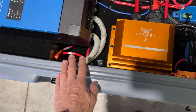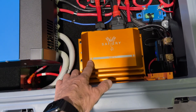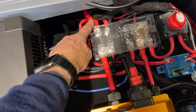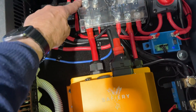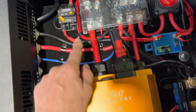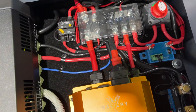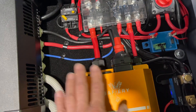We've got a Scotty in here which is doing the alternator charging in this pack. We're coming in with twin 50s from the alternator using Amphenol connectors at the back, coming into this mega fuse block here. So we've got 12 volts coming in here and then 12 volts going back out here for the 12 volt distribution, because Scotty is bi-directional — so when the vehicle's not running, the power is running in reverse and the 12 volt distribution system is live and running all the time, either from the alternator or from Scotty.